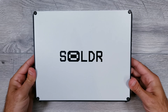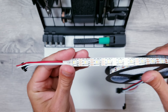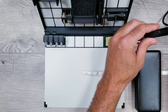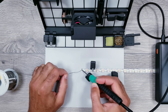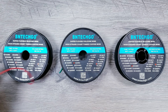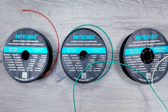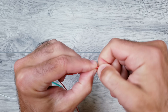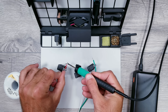Next I'll go over how to prep the strips. I'll take out my all-in-one soldering kit — I'll leave a link in the description if you're curious. I'll cut off the first LED and then apply some solder to the three copper pads on the strip. Using this USB-C battery pack to heat the iron, it can get up to about 700 degrees Fahrenheit, but for stuff like this I'm generally keeping it at about 600 degrees. The kit comes with lead-free solder, but I still prefer my leaded solder — this stuff from Kester is the best I've ever used. Next I'll prep my own wires to attach to the strip, which gives me the flexibility to have my controller and power further away. Red will always be power, green will be data, and white or black will be ground or negative.